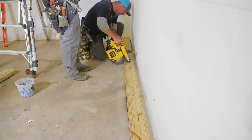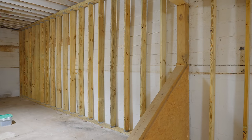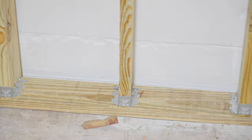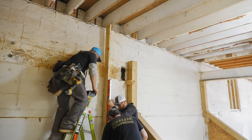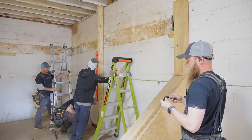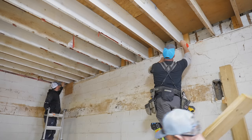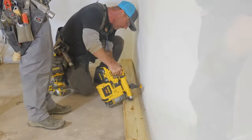We got started by setting the top and bottom plates in place, which was a little tricky due to the severe bow in the middle of these walls. We wanted the studs in contact with the wall in the center, since the support those walls provide was the entire point of building them. Eric came up with a simple but very effective technique: he took a straight two-by-six, held it tight to the center of the wall, and plumbed the board with a level. Then we marked where the board intersected the joists in the floor above and at the slab, repeated this every four or five feet, and connected the marks with a chalk line to get our layout line for the bottom and top plates.